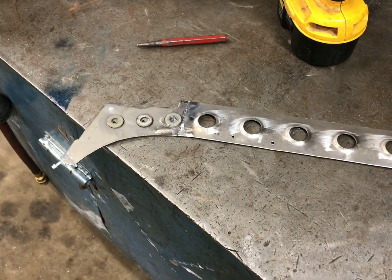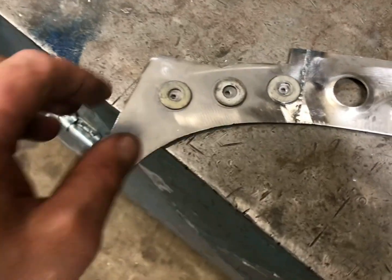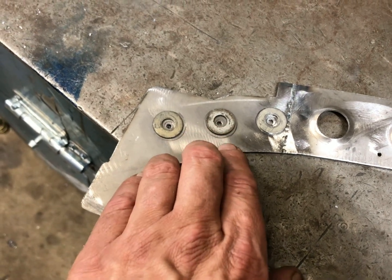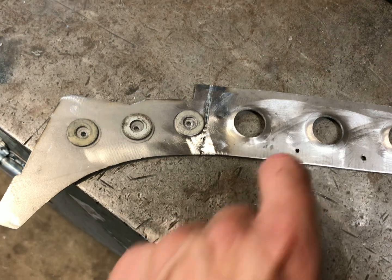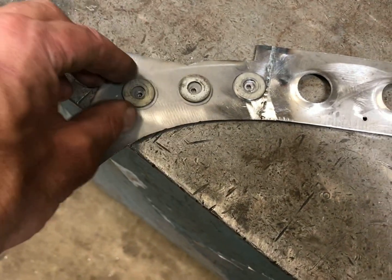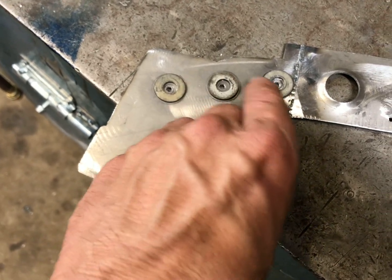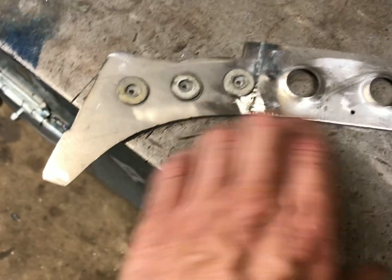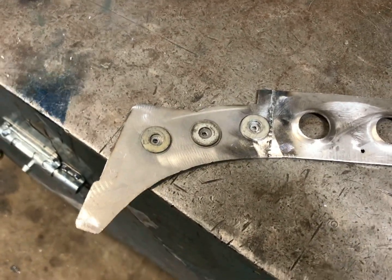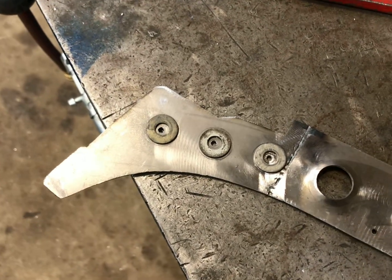So I wanted to show the front holes laid out here, the 1/2 inch holes, the 3 smaller ones here. And you can see I got them laid out on there, and I use this trick, slotted washers on there, and these washers are about the same size as what the dimple part is going to be, like the outside here, kind of the depression. And so I laid them out there. This one I centered right in the middle. It was just 5/8 inch here, 5/8 here, 5/8 here. Set that one as my starting point, and then same 5/8 here, 5/8 here, 5/8 here, and then I just tried to somewhat eye it up so it has a center line kind of curve that rolls here. So some of the stuff I just do by eye, and I think that's going to be pretty good. I got the pilot holes drilled there, and if I can get this drilled and get this dimple died, this project is almost done.